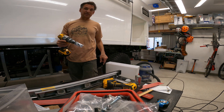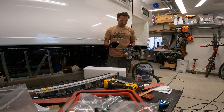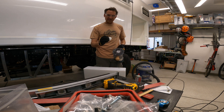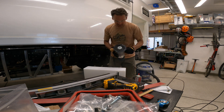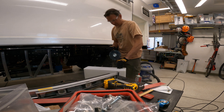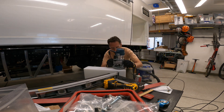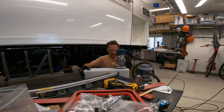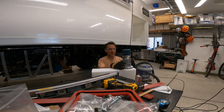I'm going to pull this plug out and spin weld this fitting on. Things are getting a little packed in the workshop so it won't be the best shot, but it should be good enough. I take my spin weld fitting, put it in the fixture I have in my router, and get this on there — make sure it's seated in there good. Now the fixture is on with the router. This is the tricky part. It's always a little tricky — the water tank is a little wobbly because I have a tank fitting on the other end.